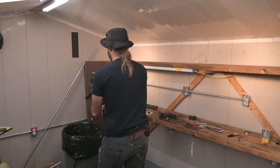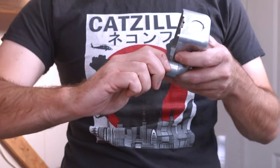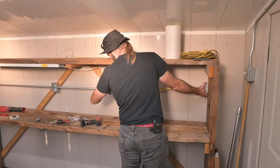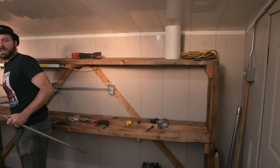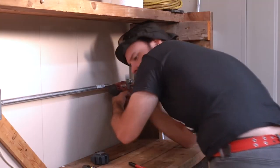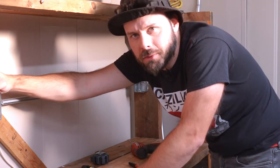Let's do up the last one — the last box. Let's check the timing on our last conduit connector. So survey says... that'll do — I'll be able to access it. 36 and a half inches. Let's chamfer and deburr it again. Let's hammer that down. You know what's ironic? The size of boxes is rated in milliliters — electrical measured in the same form as liquid. It's kind of ironic since water and power don't mix.